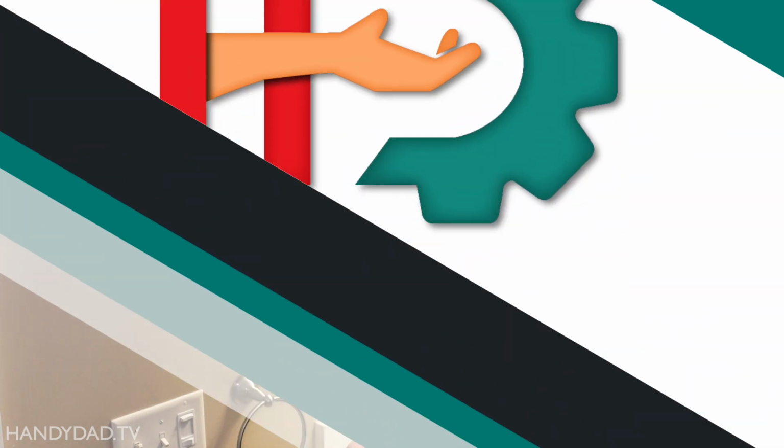Now, I don't know actually who makes the decision to only use one GFCI to cover multiple bathrooms. Would that be the electrician? Would it be the architect? Would it be the builder? But they only saved about $10 doing it. So I think it's kind of a waste, and that's why I think it's more appropriate to put the GFCI somewhere where the fault could occur.